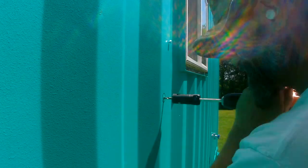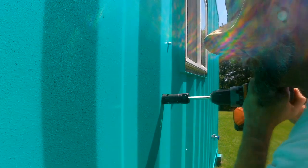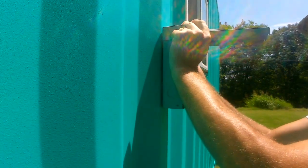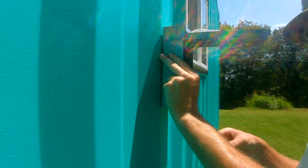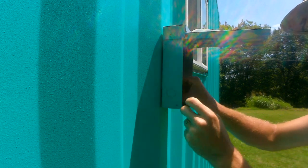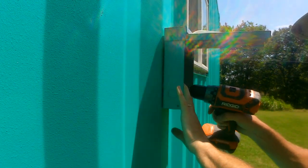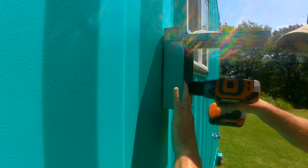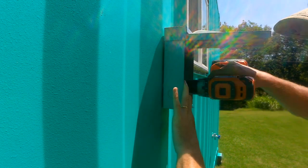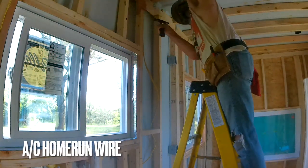You can see drilling the hole through for the actual wire, and you can see that self-tapper just above — drill that in and you can set the box and trace out your hole just like that. Set the box down and there are all kinds of places to attach it. Make sure you allocate where you can attach it to one of the flat corrugations and not one of the ones that's recessed in. Always something to think about with these containers — kind of trial by fire, live and learn.